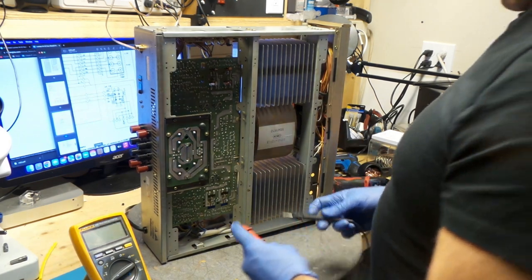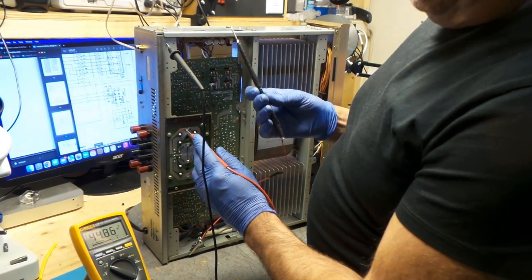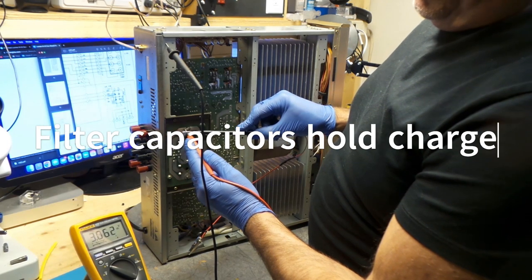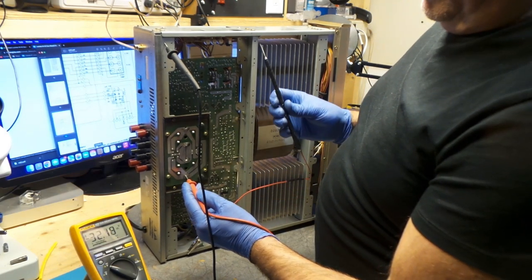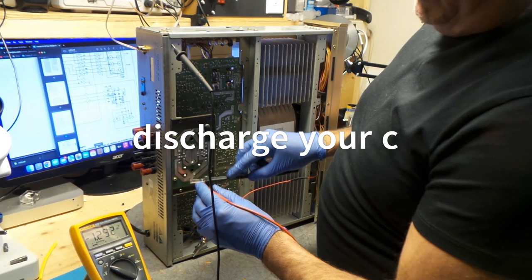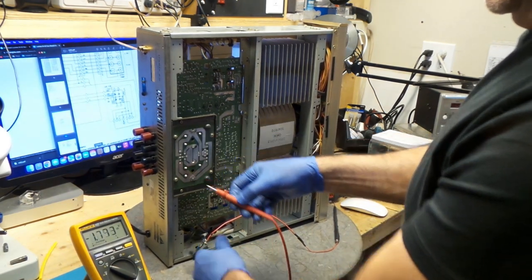Alright, power this off. Unplug this. Since I want to get into here and check some components, I'm going to check my voltage. My voltage is going down, but if I don't want to wait, I can use my voltage eliminator, I call it. All I have to do is touch. There it is. It's down to 4, 3, 2, 1 volts. Let's try this one. 33 volts. And this is hooked up to the chassis. Get rid of the voltage. Here it is. 3 volts, 2 volts, 1 volt. There you go. All done. So I have no more voltage here, right? Try it. 1 volt.